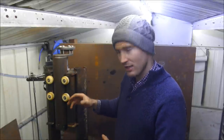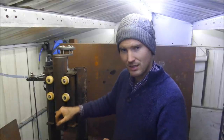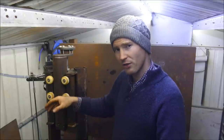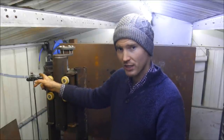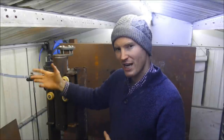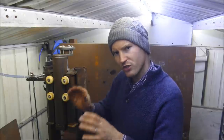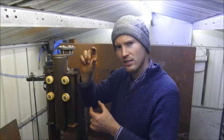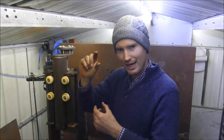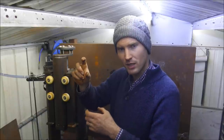So after that, you then saw me put in the new valve setup, the proximity sensor and the brain box. And I've also connected the treadle to the ball valve, which I was using as a safety on-off. I've now changed that to be the control of the power hammer. So let's focus on the valve. Now, the reason why it has two solenoids, and the solenoids are basically electromagnets that adjust the valve position.